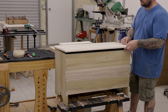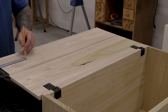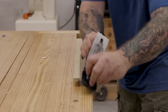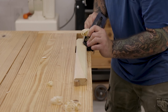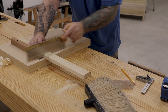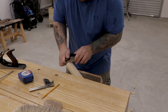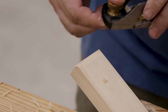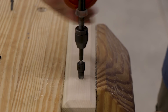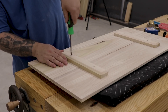Now I can start laying out for where the battens on the lid are going to go. The battens are just two wood strips that run across the width of the top to hold it flat. I'll start by marking out the batten placement on the underside of the lid. Since these wood strips are visible every time you open the chest, I want to make them look somewhat decent, so I'm marking out chamfers on the sides and ends of each batten. I'll create the chamfers on the sides first, then mark the board in the middle and cut it in half to create two battens from one board. I'll chamfer the ends with a block plane — I didn't make any measurements, I just kept planing until it looked good to my eye. The battens are going to be held to the lid with a couple of screws, and I'm drilling the pilot holes now with a little extra oversize so the lid can expand and contract without splitting. I'll attach the battens to the lid with screws only — no glue.